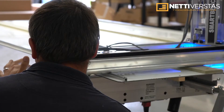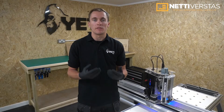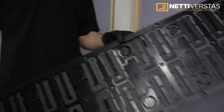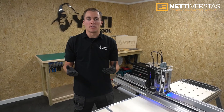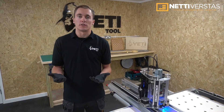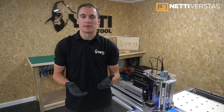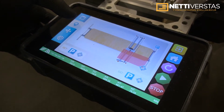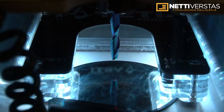On quality and reliability, each machine undergoes a six hour quality control procedure before it leaves the factory. We even use two machines ourselves to make SmartBench's own components — these machines run in a production environment for five days a week, nine hours a day. SmartBench continually monitors itself and can give you maintenance reminders for maximum uptime. Features include preventive maintenance reminders, job file checker, placement map and boundary checker, the z-axis probe plate, and laser datuming.